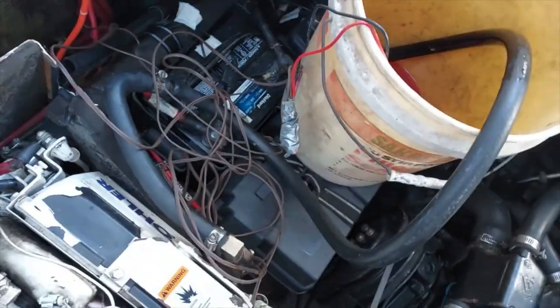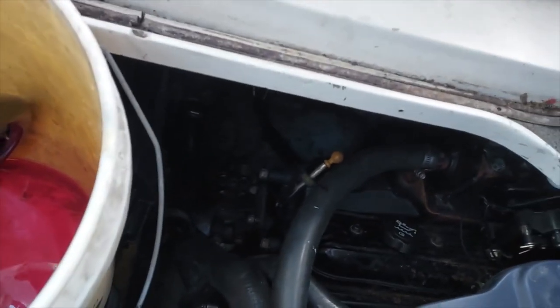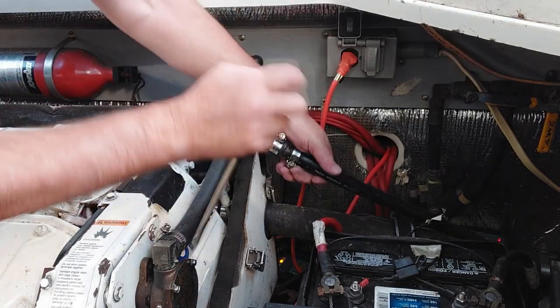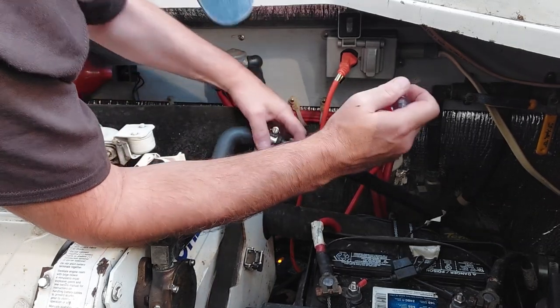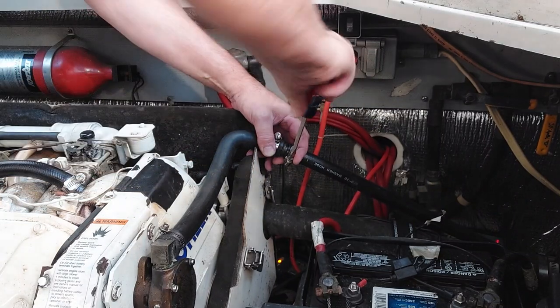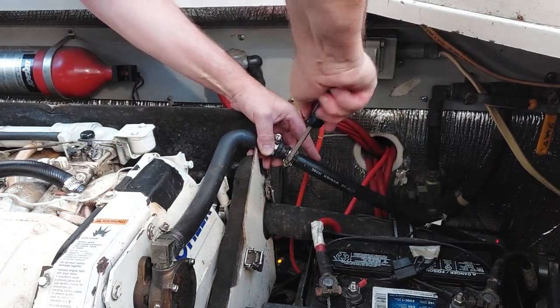So now we're going to put our hoses back, cover this unit back up, put the extra antifreeze back in that one jug, and turn off the seacock — it's way down there on the floor in the bilge. I always remember to tighten my stuff back, make sure it's up all the way. And when we're on shore I'll blow this line out going back to the sea strainer, basically by running some antifreeze through it and then some air.